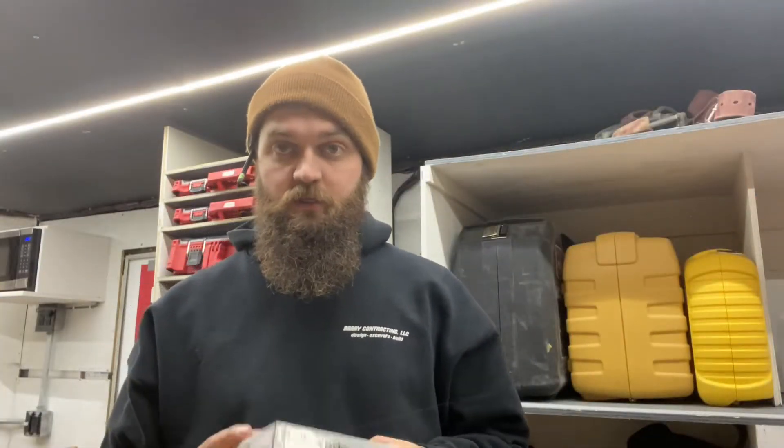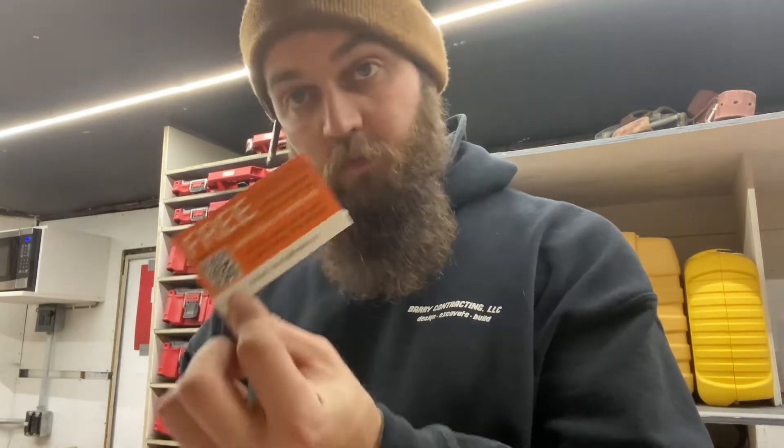The lights we're using — LED... Finding Nemo, I'm not sure — I got these on Amazon. Let me run through the specs quick. Lamp type is 12 volt, so it works with all of our other 12 volt accessories. 120 LEDs per meter — they have a 30, 60, and 90 option as well. Waterproof rating is not very good; these are indoor use only, IP20. Color is 6000K, so that's the brightest, coolest white you can get. It came with a free six-month extended warranty, which I'm not going to worry about because these things were like $12.